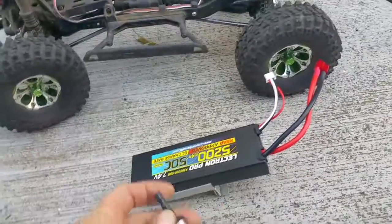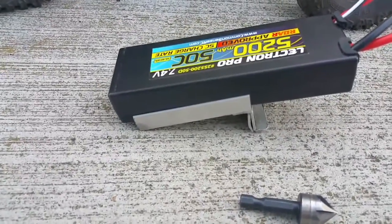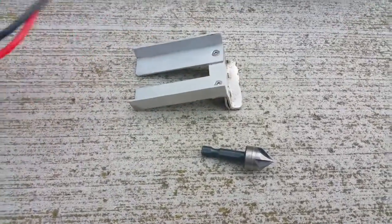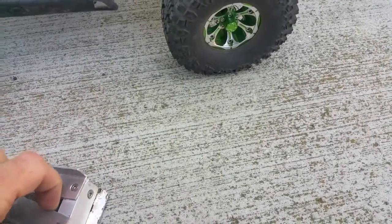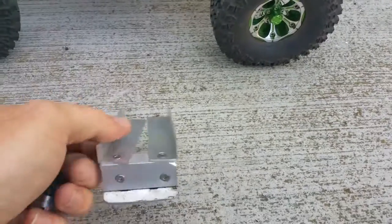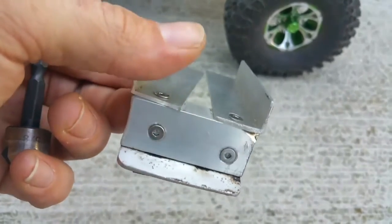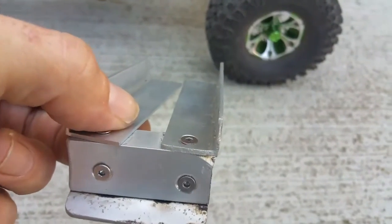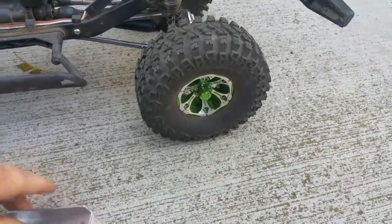Just wanted to make a small adjustment to my material-center full-size battery tray fabrication video. I didn't really mention one tool I used: a countersink — it's five-eighths — just to open up the screw holes and allow the pan head screws to fit flush. It's not absolutely necessary, but you definitely don't want a big screw sticking out the top, otherwise the battery will put all the weight on the screw rather than on the new tray.